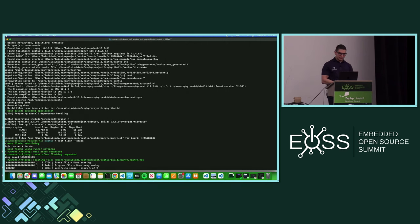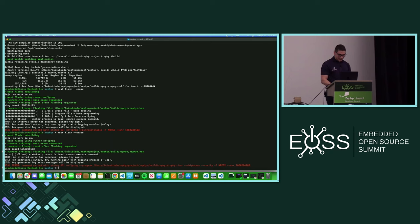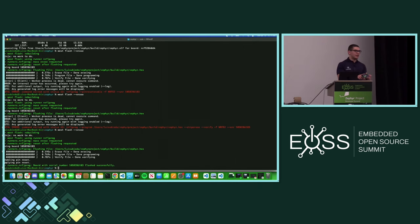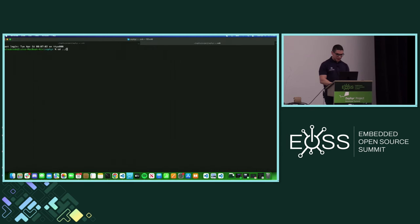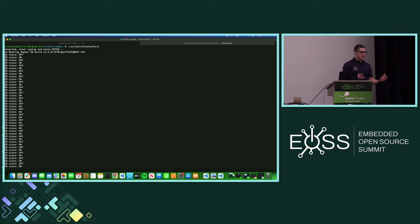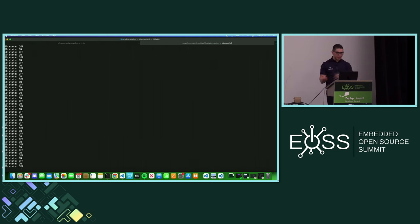I'm going to flash it right now. There was a small failure on the onboard J-Link emulator but we got through it. Now I'll open a new tab and use a Python Bluetooth CLI client. As you can see, this is not connected over USB — the board is broadcasting with the NUS service, the computer is finding it, connecting, subscribing to the characteristic to receive data, and you're getting that. You now have a console over Bluetooth LE.